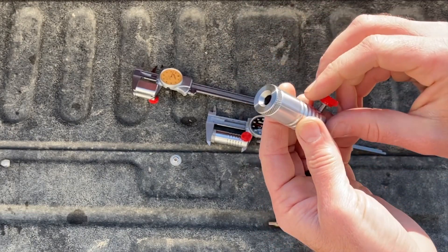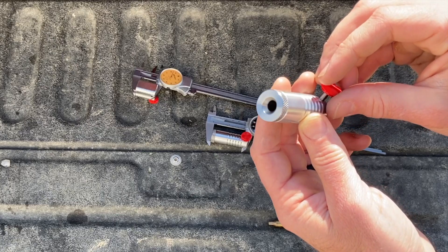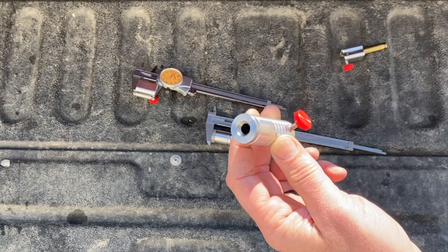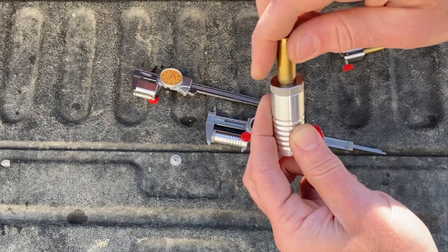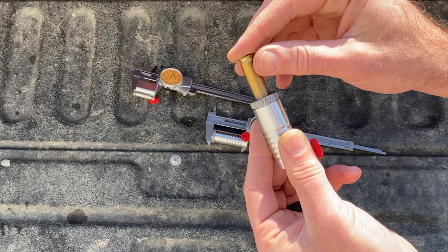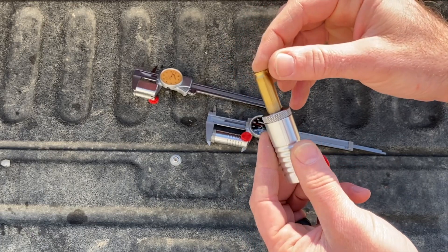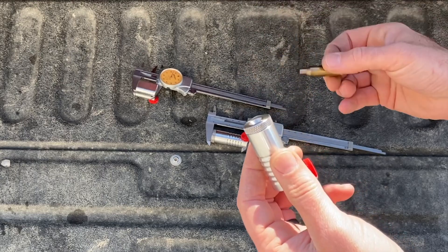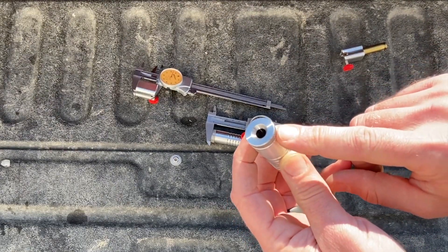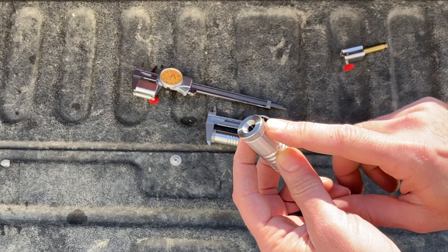There's no way it's going to come out. Plus, we machined this from 17-4 stainless, which machines really nice, and I always like to have more of a metal-to-metal, good solid contact on tools like this. I don't like aluminum, I don't like the Hornady style tools where there's just a really small little band of material that's touching the brass.